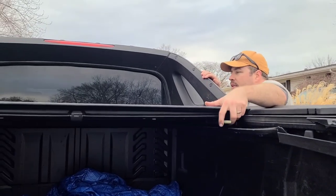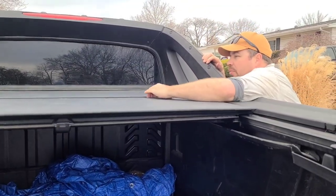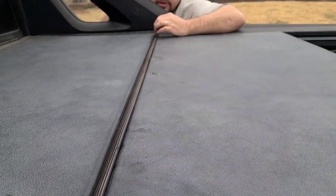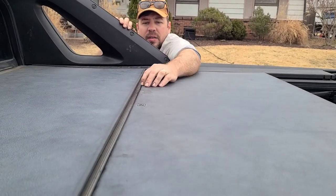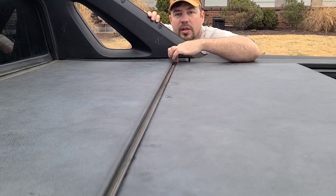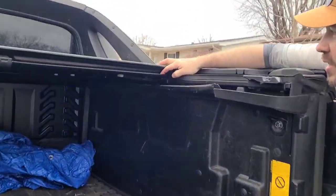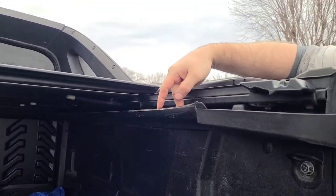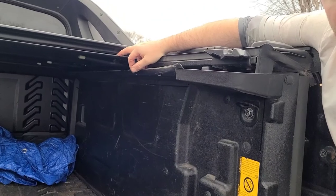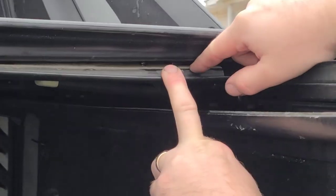So we put it in, holding it in there well, and locked it in. Hopefully putting the silicone in there will help hold it in place. Later I'm going to come by and lightly silicone right on top of here so the water seals and runs out here and down into the gutter. I'll also pull this panel off another day, clean it real well, and silicone it - because it had two-sided sticky tape that has worn away, and now water catches and runs out the back.